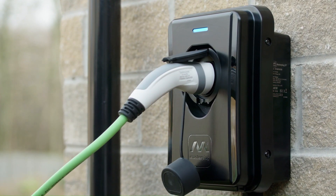Some of the key features and benefits of this range is the fact that it's got pen fault built into these chargers as standard. That means you've got no earth rods to go into the ground and it's not a messy installation. The other safety feature built in is RCD protection, so you don't have to put these upstream. That makes your install work much, much easier.